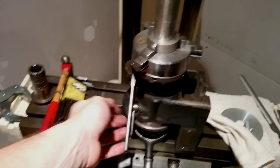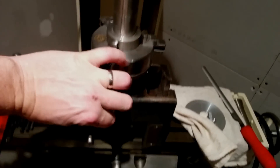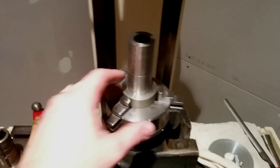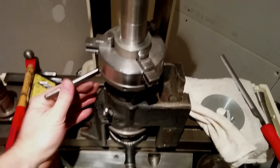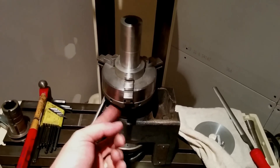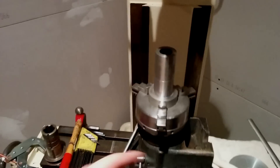For those who haven't used these indexers - you flip that out, it just engages a pin. There are multiple pin settings in here and it's a standard setup. I'll be doing six passes, so geometrically it's fine - I'll match the pattern. You just turn this to get to the start position. I'll have to set up a tripod when I actually do the work. I do my first pass, then ratchet over to the next spot and it drops in - it's locked in. Do the next one, Bob's your uncle.